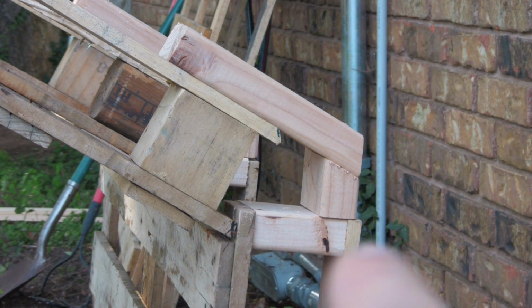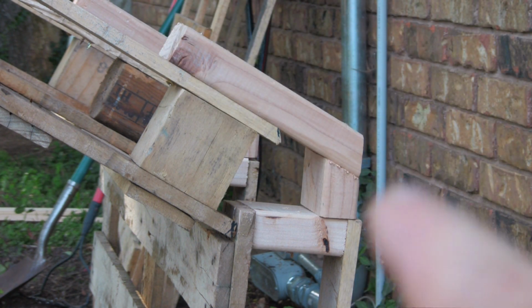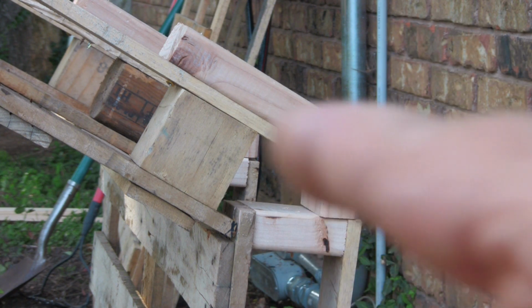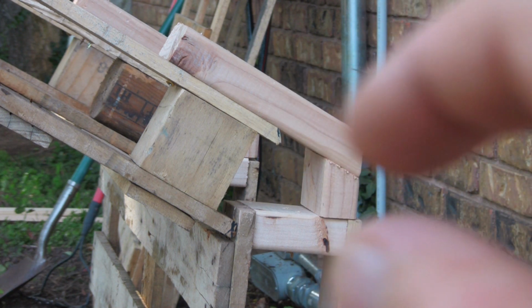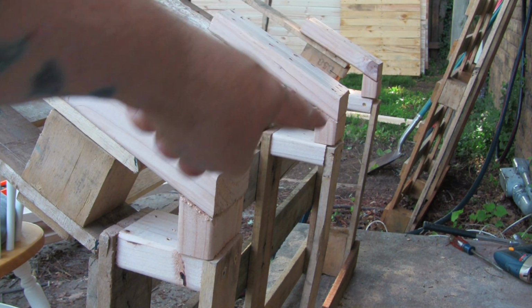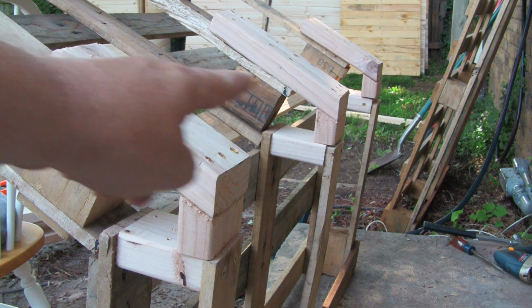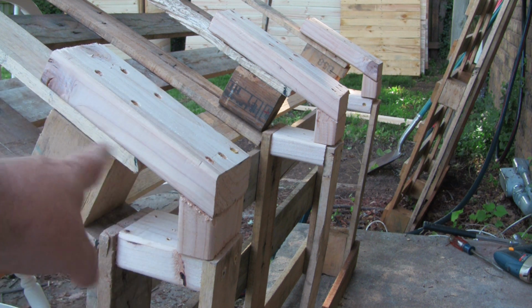So what I had to do from there was make this piece off of the back go into the ground, and I had to figure out the right angle for that, which ended up being 22.5 degrees. So then I had to make this center piece flat on this side, 22 degrees on this side, and make it so it fit right in between those 2 pieces to lock everything together. So I did that all the way down, all 3 pieces. You can see we have the same angle here on all 3 pieces, and that's the 3 pieces I used to make this structurally sound.